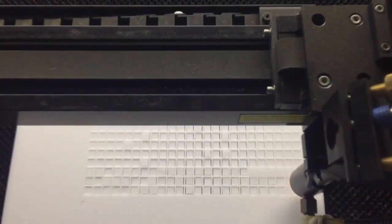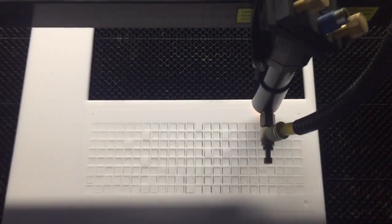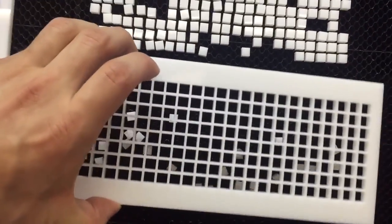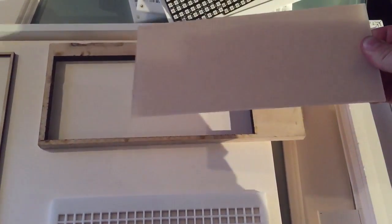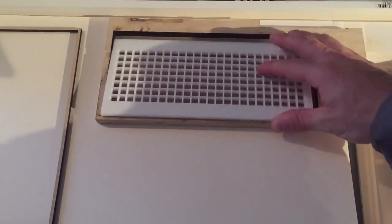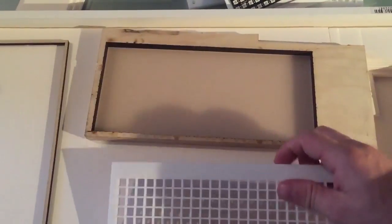So I rebuilt the calendar case last night at Noisebridge. There I did a bunch of laser cutting, and as a part of this redesign, it requires a new kind of rig so that when I go to do the acrylic cementing, it's perfectly aligned, and I'll show you these pieces. The 9¼ inch by 4¼ inch needs to be perfectly centered onto the rest of the calendar pieces, which is still a 9x4 because there's no need to make the whole thing the full size.